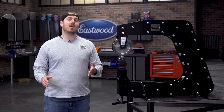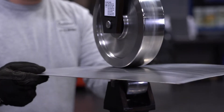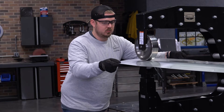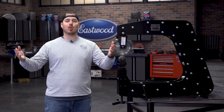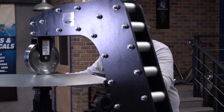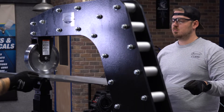This thing is capable of forming sheet metal up to 16 gauge mild steel, which is perfect for any part you're going to be building with this wheel. It has a 25 inch throat, which means you can roll a piece up to 50 inches wide — an entire 4x8 piece of sheet metal. So door skins, fenders, quarter panels, trunks — no longer an issue.